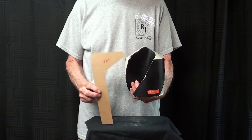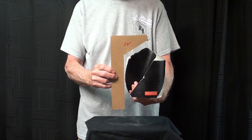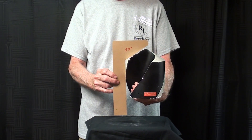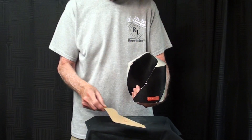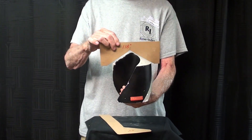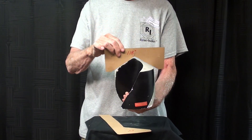When I was in my prime, I made up a drill gauge out of cardboard or sheet metal just to show the class that this is the angle we're after — 59 degrees. Or, if you have another type of gauge, the included angle is 118 degrees. That's the basic primer on the angles of a drill, and again, you need to know that before you attempt to sharpen it.